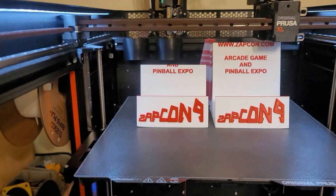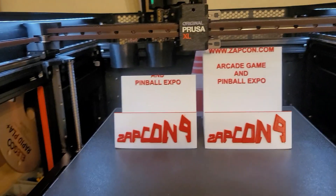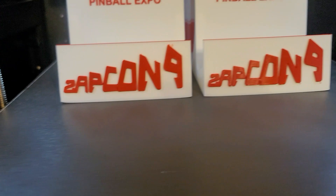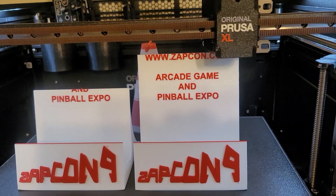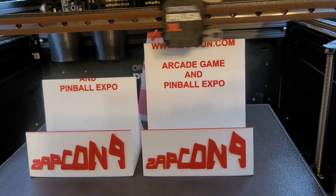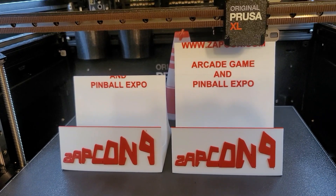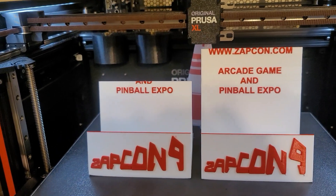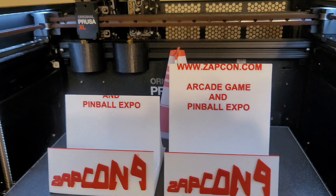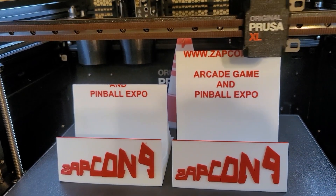This is a weird one — it's a firmware issue more than likely. I canceled the print on the object on the left because there's a lot more curling in the corner. This one's got a little bit but not bad. The print still does normal printing on the right, but when it goes over to the left it's like it's printing but not extruding — it canceled the object but still does the moves.